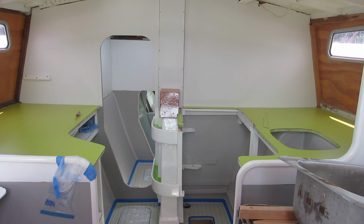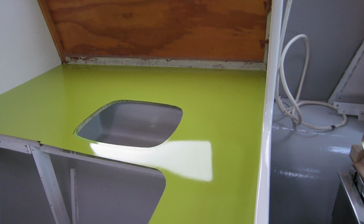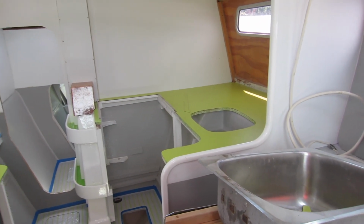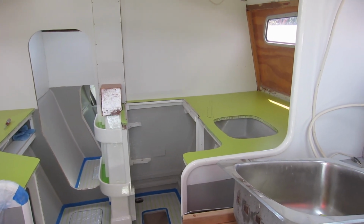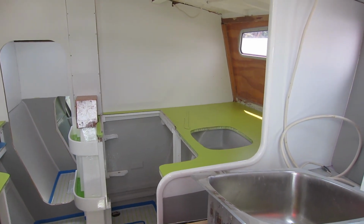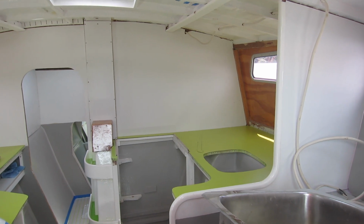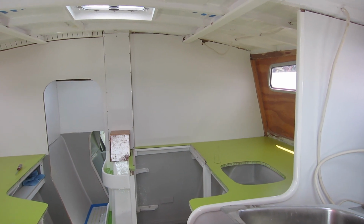Like I said, or what you've seen before, we decided to redo the countertops, and that's actually what you're seeing here now. These are the new countertops, or the new finish for it. So it's the Formica that has been cut out, and we haven't glued it down yet, so we're gonna spray the same polyurethane that we put on the floor, and hopefully we'll be happy with it. It's also to give it more protection. I mean, you could leave it as is now, but it's a little bit more fragile. And then if you put some polyurethane on, that's so hard.